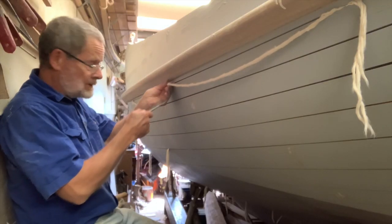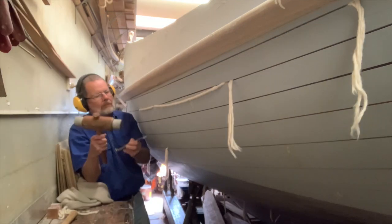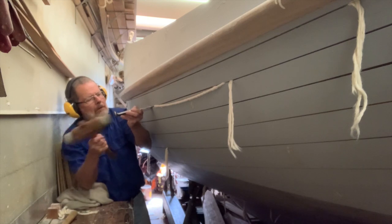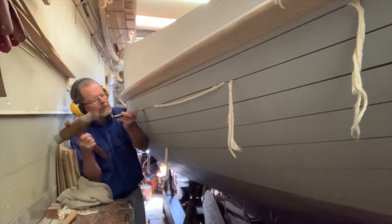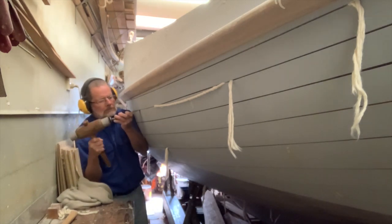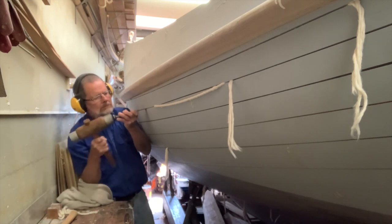Pin it along the seam with plenty of slack — don't worry too much about how much slack, you can adjust as you go. Pin the nearest section to the start, about 300 to 500 millimetres — about a foot to a foot and a half — and then choke it into the seam with a narrow-bladed iron. Then come back over it the other way to harden up, using the widest iron that will fit in the seam without jamming against the sides.